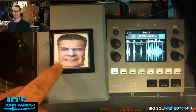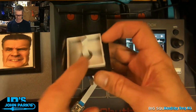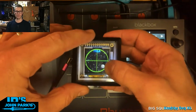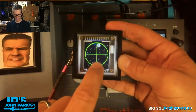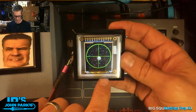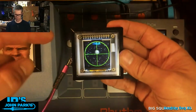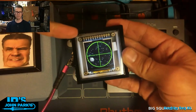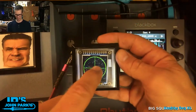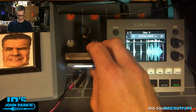There we go. I spy a cable through there for SPI and I2C, and this is not a perfect fit. So this will still function, in this case as a button. That's the neat thought that Lady Ada had, is these are big enough to fit. This is a 1.54-inch TFT 240x240. We probably have some others that are a better fit because they don't have as much PCB. This could make your gigantic version of a keyboard with one display per screen. That's how you would potentially set that up.